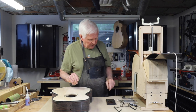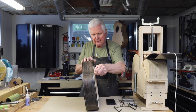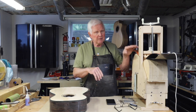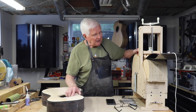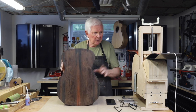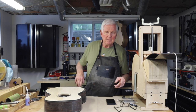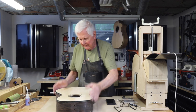So what I did is I had to make some more binding. I had to get some more wood to match this, get the purfling, and glue those together. This morning I took those out, ran them through the sander, and I've now put them into the side bender. I did this because I want the same shape for the binding, and I can then take that and tweak it on the other hot bending machine I have, just to make sure it fits nice and neat.